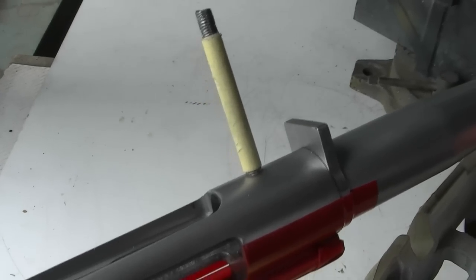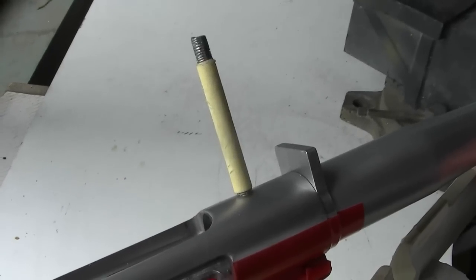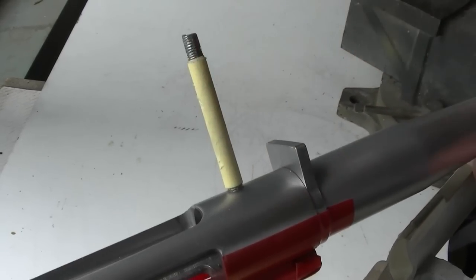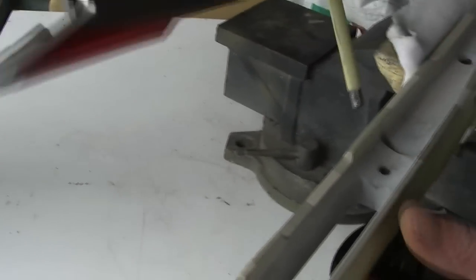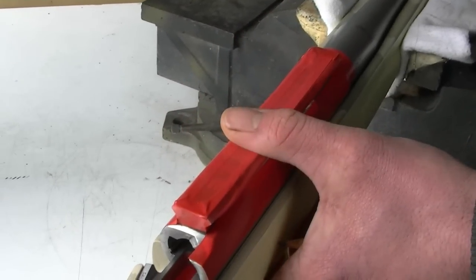The first tip is fitting the rifle into the stock. We want some height reference points. I've fitted a blind screw — a headless screw — here, and I'm going to use that to line the rifle into the stock just to begin with, giving us some ideas of where we're going. So I'll put that in place, only partially into our prep.